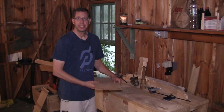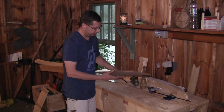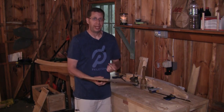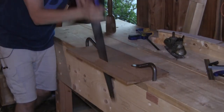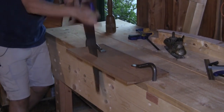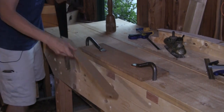Now I'll turn my attention to the interlocking slats. I've got a piece of teak about three-quarters of an inch thick — it's band-sawed and has a pretty significant cup to it. One of the fastest ways to flatten a cupped board is actually with a saw: I need three-inch wide slats, and when I rip a three-inch wide slot out, I'll pretty much eliminate all that cup. Don't get too caught up in perfectly milling boards when sometimes all you need is a saw.